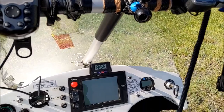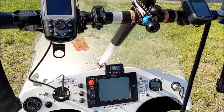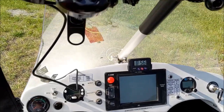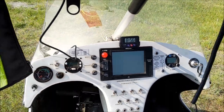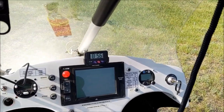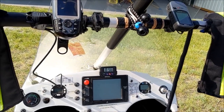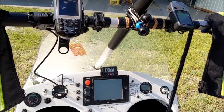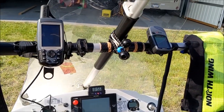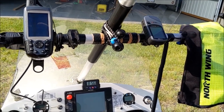Also, the altimeter shows about 200 feet higher elevation than actual, compared with GPS. And because my transponder also works on the same principle of static pressure, the control tower also sees about 200 feet higher elevation than I'm actually flying. So I'm reporting this to them, but actually I am about 200 feet lower. This is not a big deal, 200 feet, but it's annoying.